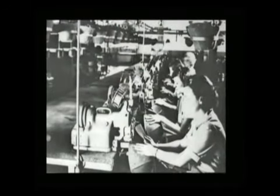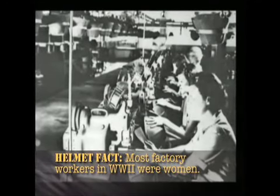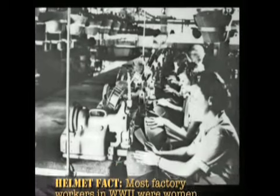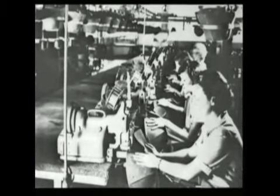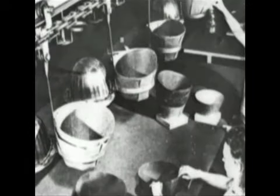The manufacturing process for converting the raw duck cloth into combat helmets was complex. It required many steps, both with machines and by hand. For example, after the duck cloth had been soaked in resin, it was cut into discs and then stamped into a hat shape. Once positioned in their hat shape form, the liners were then placed onto a conveyor system to be taken to the molds.